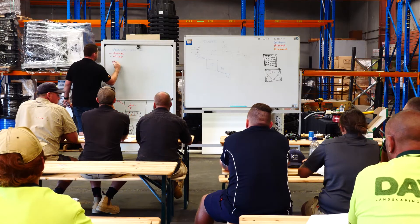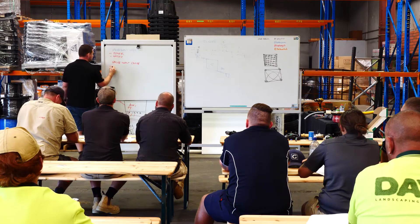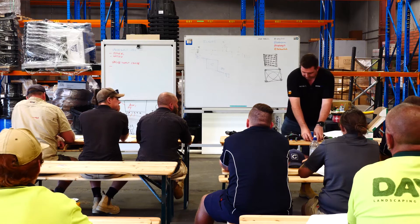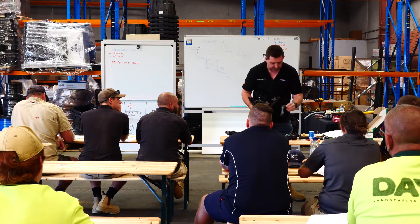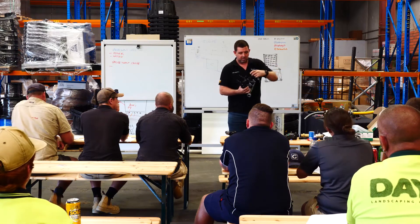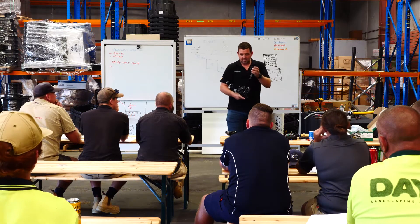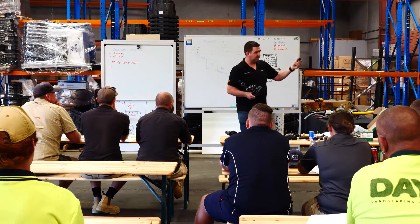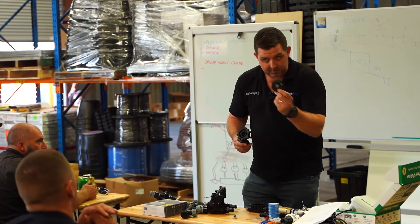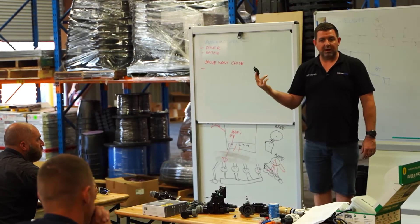So, it won't close. Why would the system not close? Debris - definitely debris. With a solenoid valve, there's not much that can go wrong but they do have sensitive areas. You could have a small amount of dirt on the coil that stops it from closing and dropping down. You could also have a rock under the diaphragm that's stopping the diaphragm from closing. Ideally, you want to check that first - it's just screwing the top off, without getting tools out of your car. But if dirt has created damage, it might have actually torn the diaphragm.